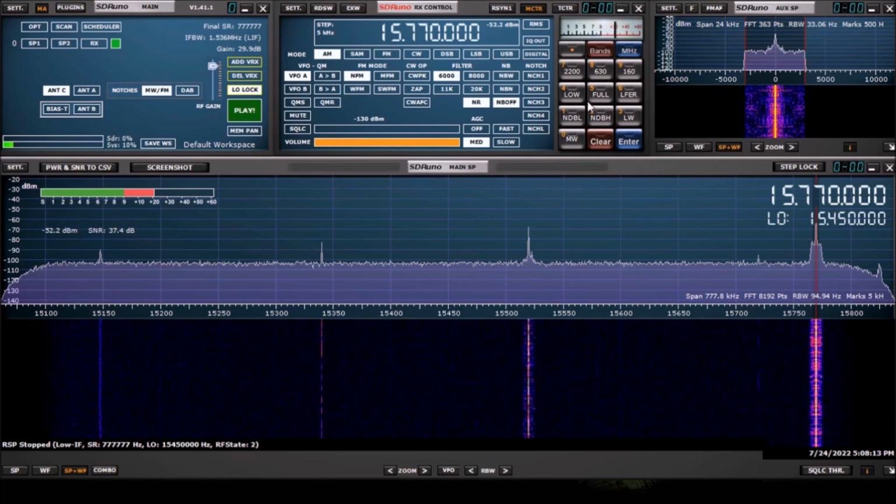Now, what that's going to show you is these HDR bands. You have medium wave, you have long wave, you have non-directional beacon high, non-directional beacon low, then you have LF. This has the full spectrum from all the way down the long wave to the medium wave. This is just showing you the full spectrum. And this is the one that you're going to pick for WWVB. This is the VLF low setting. Okay, you have to pick that. And then, of course, you've got the 160 meter band, the 630 meter band, and the 2200 meter band. So if you want to get WWVB, you're going to have to pick this one.